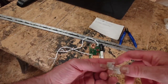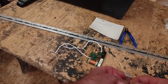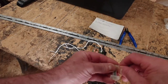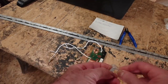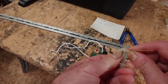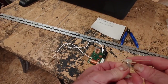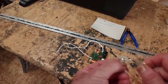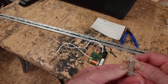We're going to start at the other end down here because that's the way they started. We want to put it down there first and then gradually just start winding. We want to make it as neat as possible — we don't want it all bodgy, we want it to go round very tight. Because we've already insulated this wire, don't worry about your fingers touching it. We're going to lacquer it again heavily just to keep all the wire in place.